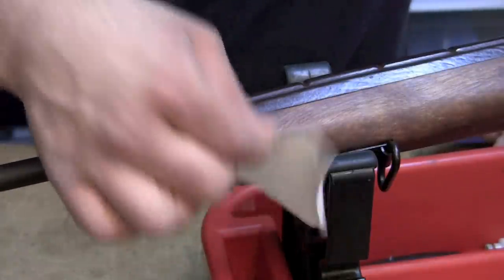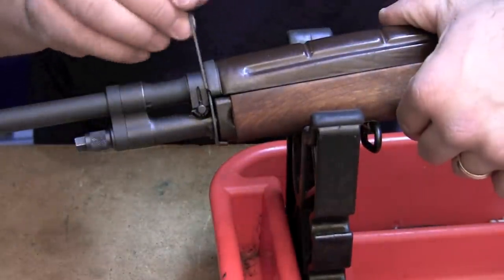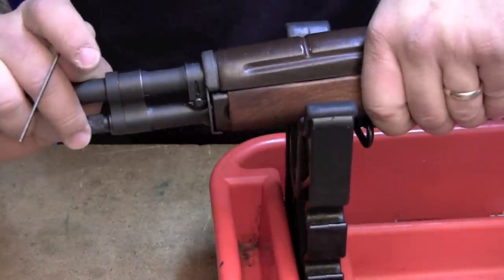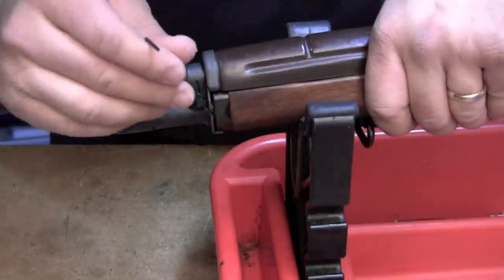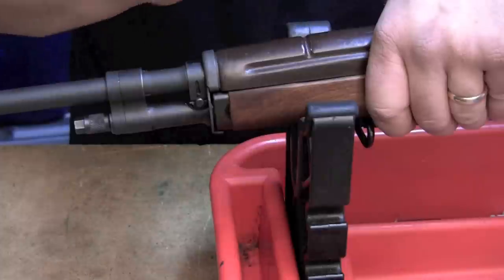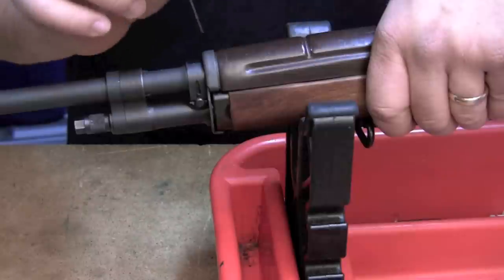The other thing you want to look for in this area are the vertical surfaces between the front band and the stock barrel. These two surfaces — you should be able to see some daylight there, which I do. So as long as these two vertical surfaces are not touching, you're good to go. If they are touching, then the whole stock needs to be bedded or custom fit to the action to correct these, because all this stuff is set during glass bedding.